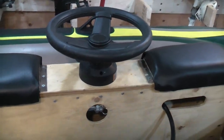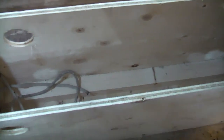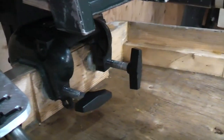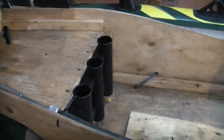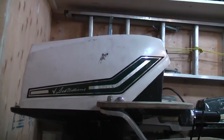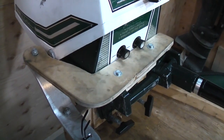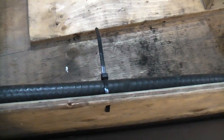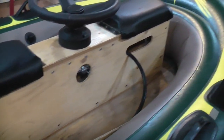So I prefer this — it also allows me to get well forward in the boat, which is where the weight needs to be when you're trying to get it moving. There's some storage here; not a lot, but it's enough to put some ropes or tackle. There are rod holders in the back. You can see the Teleflex cable steering system there. I just attach it to the boat with tie wraps, and if you need to take the thing off, I just cut the tie wraps off and put some new ones on. I put a piece of heater hose from a car, split down the middle, just to protect the Teleflex steering cable. If you're just moving the seat assembly backwards and forwards, you wouldn't need to move the Teleflex cable system — it could stay where it was.